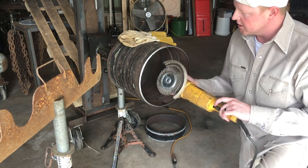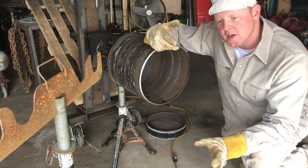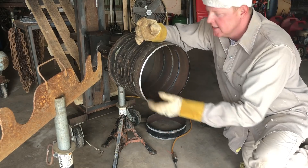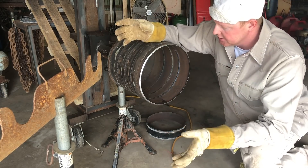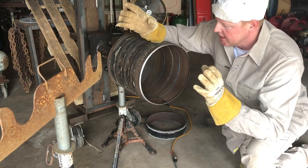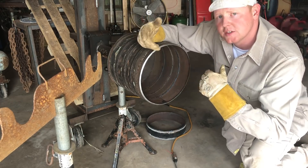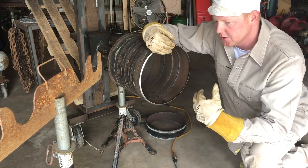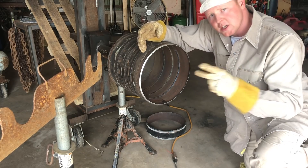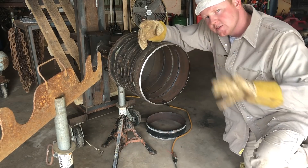Remember, like I've said in past episodes, every welder is different. Some welders are going to like a thin landing like a dime, some are going to like a nickel — it just depends on the welder. Ask your welder what kind of landing he likes and adapt to him. Another helpful tip: if you're on big pipe where you've got a brother-in-law setup with two helpers, communicate with each other about how each welder likes their landings, so both sides of the pipe match when you're making the weld.